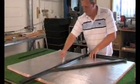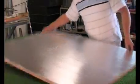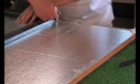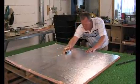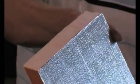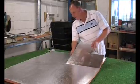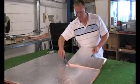The fabrication by hand is very different. It is both long-winded and time-consuming, and requires an element of skill. Unfortunately, producing the components manually opens the door widely for error. The cut edge obtained cutting the phenolic foam manually is very uneven, and this can cause major problems when fabricating. Each panel of a finished part has to be produced separately, then joined together, so a complete panel is in no way as robust or as rigid as a part produced automatically on the Axyz router.